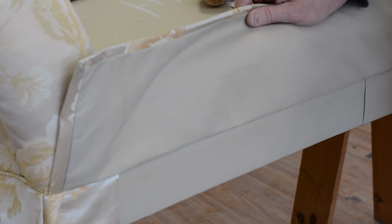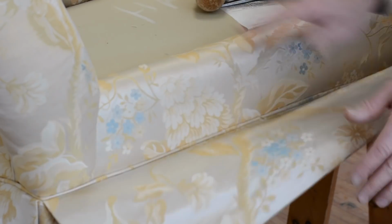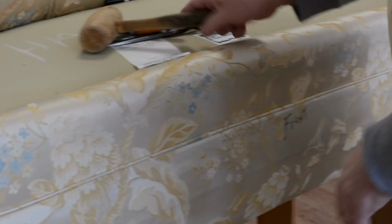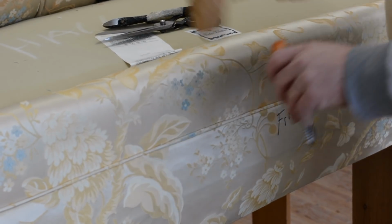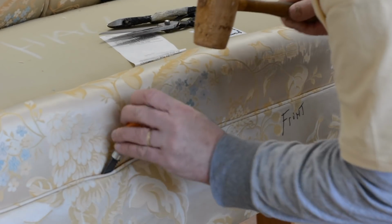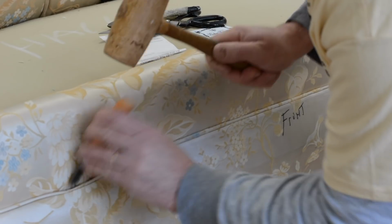Okay, what we're going to do is a little differently. You'll see, we're going to upholster all the way down with the fabric and then apply the skirt. So some manufacturers do it differently, so it doesn't matter. We need to take this off. You know, you don't have to be exceptionally careful with this because we're replacing the fabric. But let's just see how it takes a little bit of this downward pressure with our tack remover, with the mallet. We're moving it down.